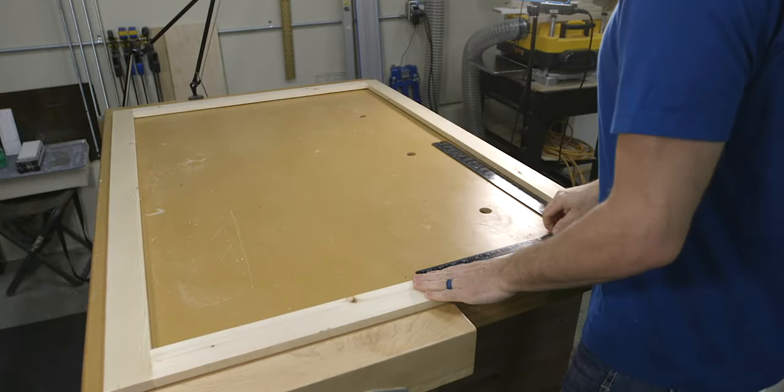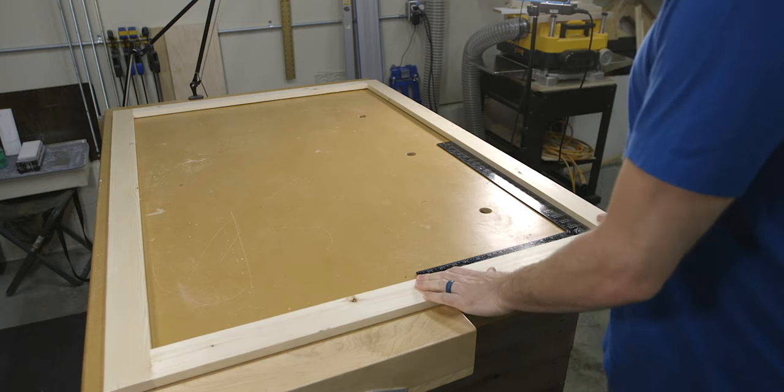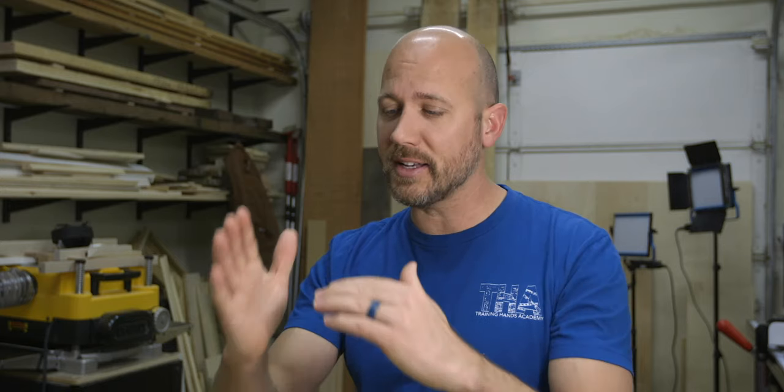Today I'm answering a subscriber's question by showing how to use the 3-4-5 triangle method for finding square. This method is generally used when a square, such as a framing square, is just too small to get an accurate measurement of squareness. For example, this method could be used when framing walls, decks, porches. It could be used for laying out flooring as well as large woodworking projects. It has many uses and it's fantastic for establishing a 90 degree angle when you don't have one.